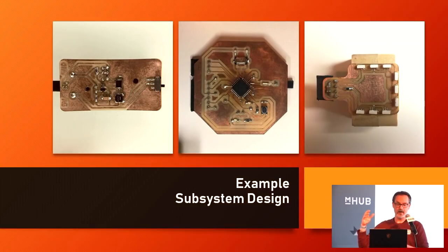I like to design by subsystem. The PCB milling process is not what you want to use for an entire design — if you've got something that'll take up a full four-by-five-inch piece of copper clad, you should probably talk to someone about getting a full board spun. This is good for testing a sensor, a new power circuit, or a new micro you want to write code for. Do a quick design, throw it on the mill, do some quick testing, and now you have a library of defined circuits that you know work, which you can cookie-cutter into other designs in the future.